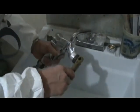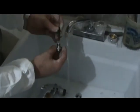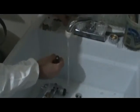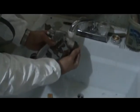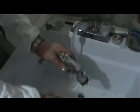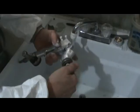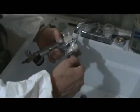Clean, and we'll just take the tip off. Make sure that it's nice and clean inside. And this is where I use a little bit of a wire brush down inside of it to make sure that we get all that paint residue out. Cleans it right up doing that, and then flush the cavity out real good with water. Always like to pull the trigger when I put the tip in and out so we're not running the needle against the hole in the tip.